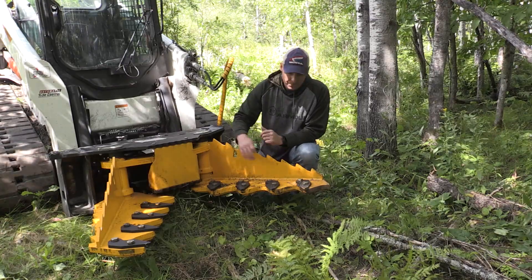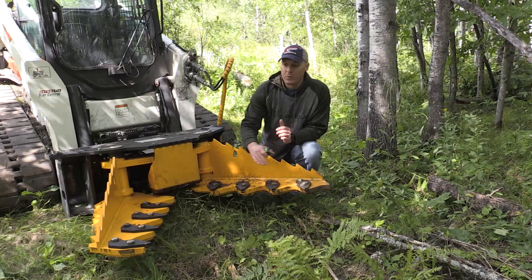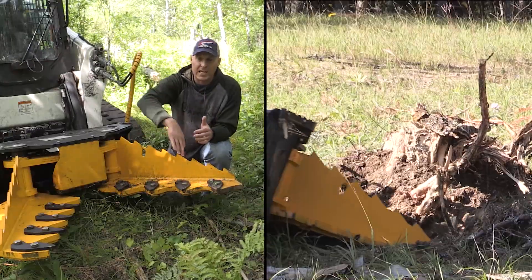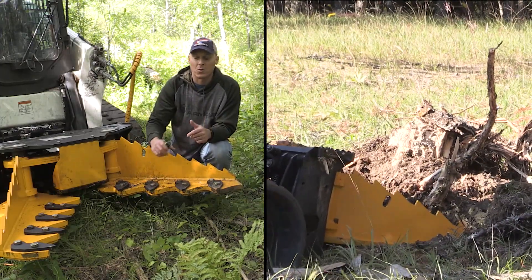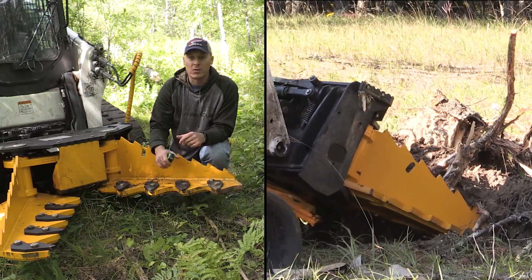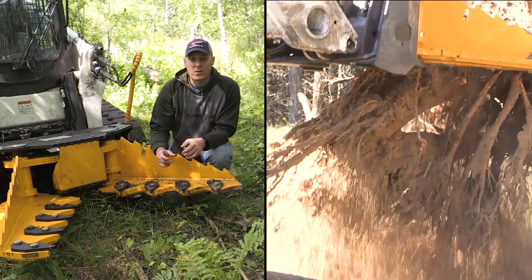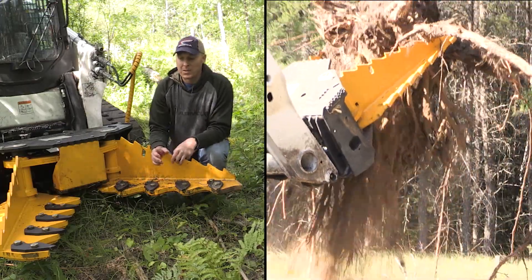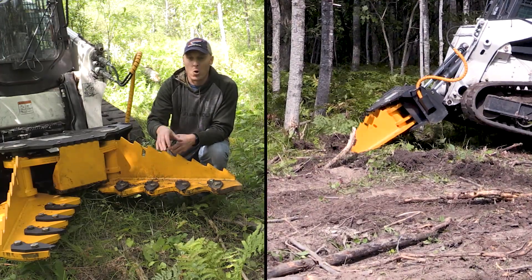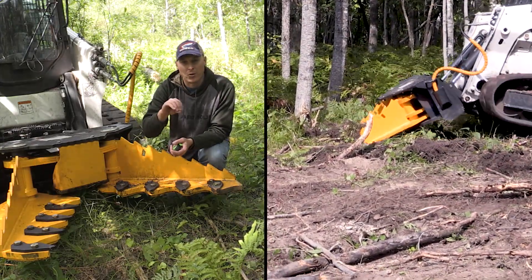There are also half-inch gussets made out of T1 that run the full length of the jaw, so it's incredibly stiff all the way to the point. That's important because the way you use this tree puller is not just for grabbing trees and pulling on them, but also for digging and snipping and pulling out roots. You can actually pull and move trees faster that way because you're getting down into the root area. It also works quite a bit better than a stump bucket because you're able to pinch in a horizontal movement and pinch those roots down low — a stump bucket doesn't have that ability.